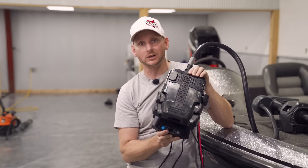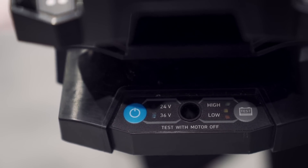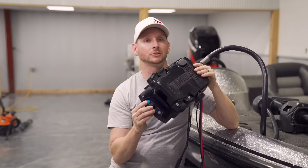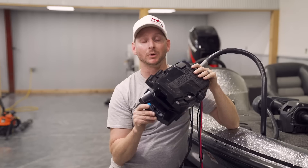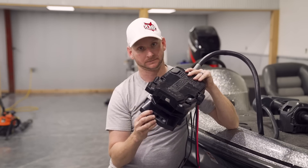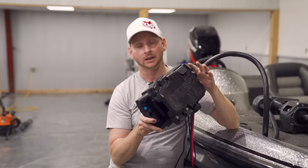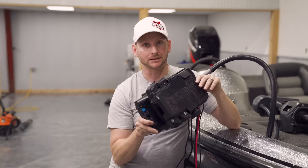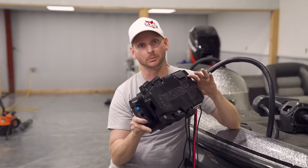We were talking about that 24/36-volt system — how easy is it to change? The button to turn the motor on also controls whether you're in 24 or 36 volts. This isn't something to flip on the fly when already wired for 36; it's for if you start with a 19-foot boat and later upgrade to a 21-footer — add the extra battery and jump wire, and you already have the trolling motor for it. There's also a battery indicator showing low, medium, or high battery life remaining. With brushless efficiency, you'll have fewer wearable parts and less maintenance than competitor brushed motors.